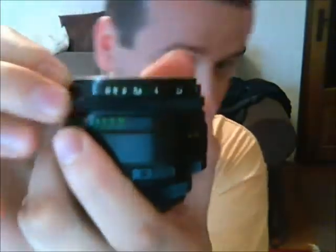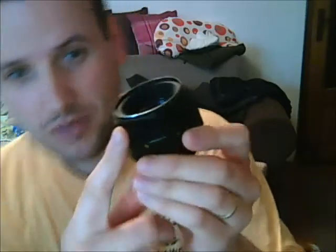All these lenses have an aperture ring here and it must be aligned with this red line. But in order to achieve this, they put a small ring inside. After taking out that small ring, you will no longer have misalignment but will gain a few millimeters depending on the lens — they are not all the same — and you will have more distance to focus.